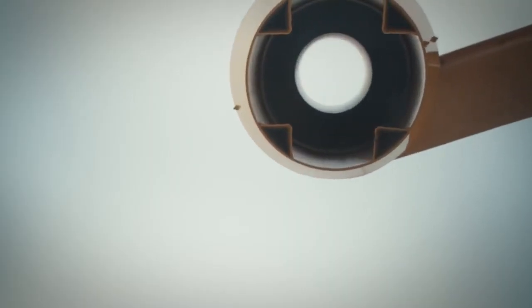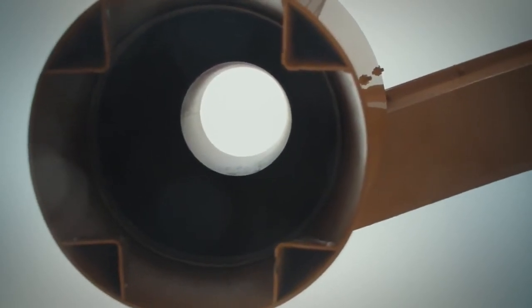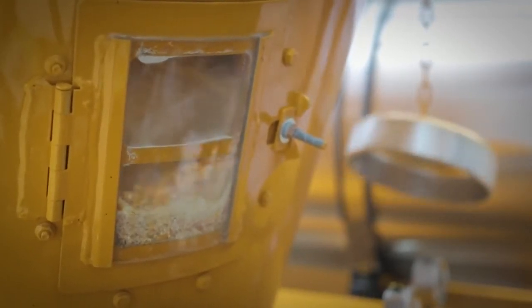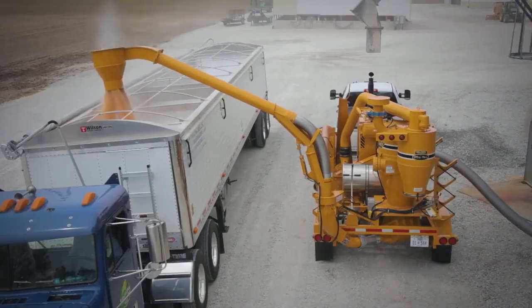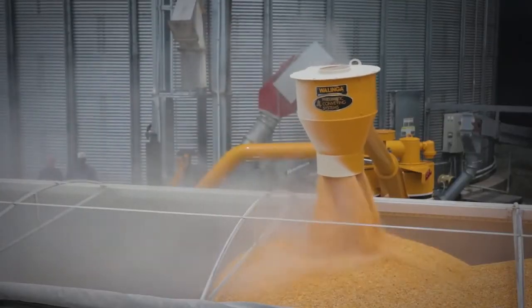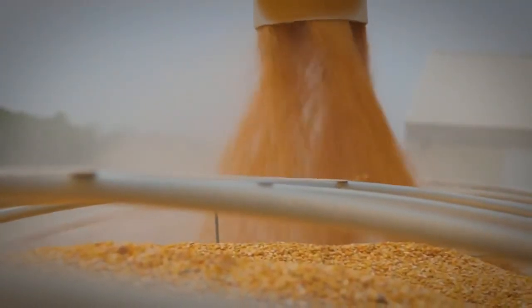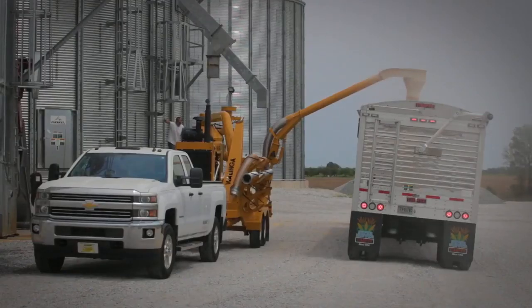Before the grain begins to flow, you can see up inside the cyclone end of the loading boom. The blue color is the hard Rhino lining for protection against excessive wear. The grain enters the receiver tank at an angle that results in a circular direction within the cyclonic chamber. Four steel corners deflect the grain into distinct paths as it exits the boom cyclone, and excessive dust and small particles are vented out the top to further help clean the grain. Depending on the Ultravac model utilized, the Walinga Ultravac can move from 5,000 to 7,000 bushels of corn in an hour.